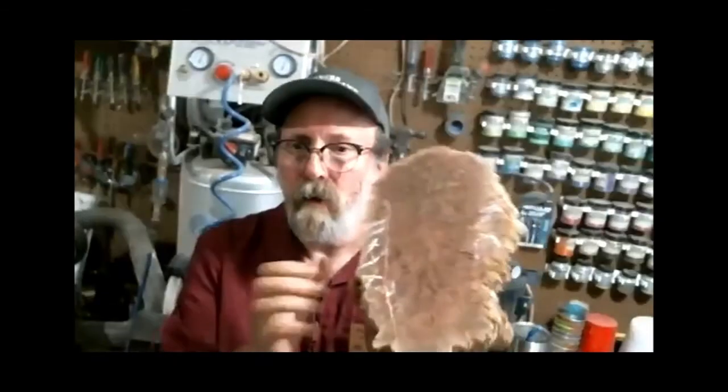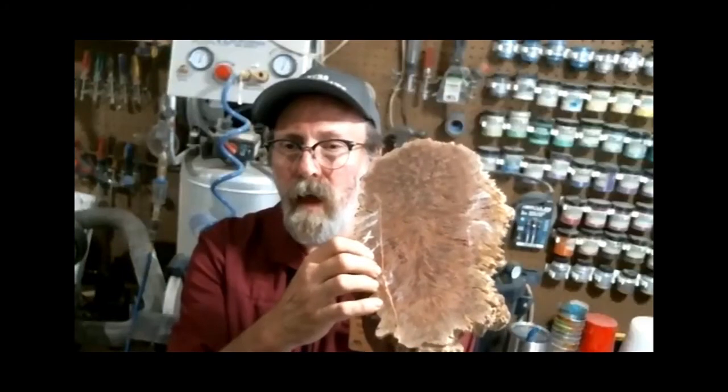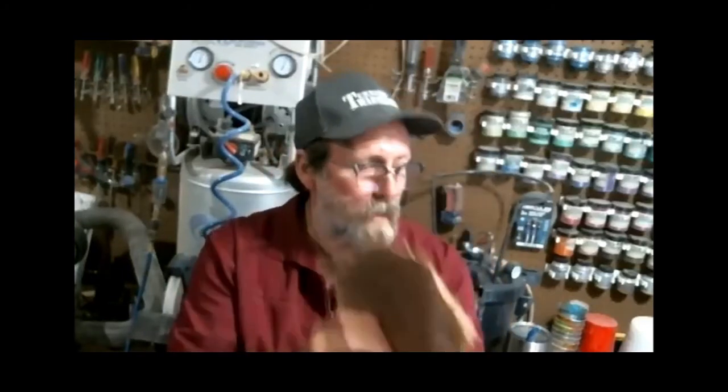We've got just a moment or two to go. Just talking about burl real quick. This is red mallee or brown mallee burl. Any of the mallees, or most of the Australian timbers, are so dense they don't take much stabilization. They won't hardly gain any weight. So if you don't have the possibility of stabilizing something but you want to cast burl, I would recommend something like that, something that's super dense, because they're not going to expand and contract with moisture. But let's field questions.